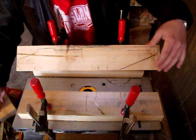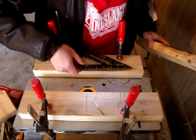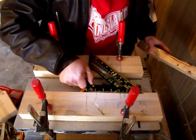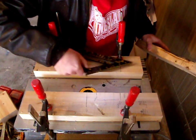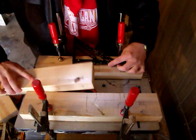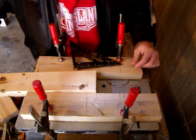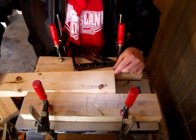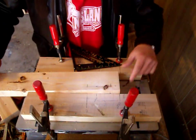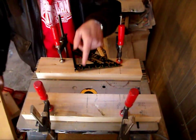On this guide I've got set up, we'll go one inch from there — which is the center of the blade — and then it's three inches long. So we'll mount them to start right there when this thing turns on, and we'll route all the way to here where it says stop. We've got a quarter inch rod in here.